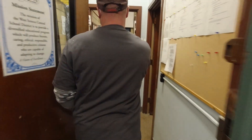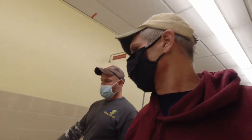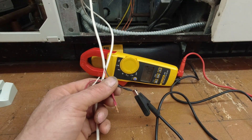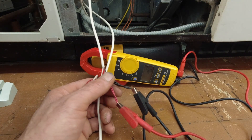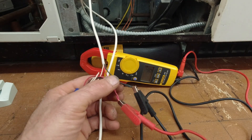It's going. Yeah, it's slowing down. Yeah it's stopping. You remember there was water running? Well the fin heat's running. It's hot, right? So — but yeah, it's still hot. Why is it hot? We're saying hey, give me fresh air, shut off the heat — and it's doing what it's supposed to do. Shut off the heat. The only thing we got left is the fin heat, the baseboard heat, whatever you want to call it. And that's staying open, so it's heating the room. Everyone's telling us not to — exactly what they're supposed to be doing here. We should have 25 volts somewhere on there. We have four volts. What the flip is going on here?